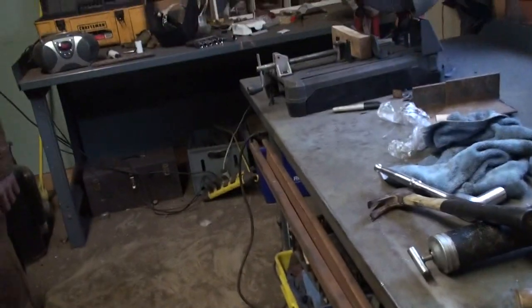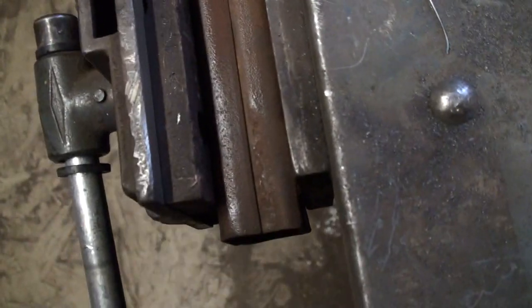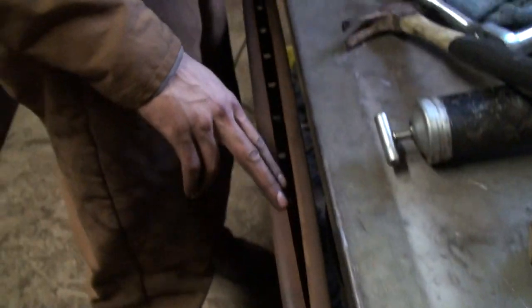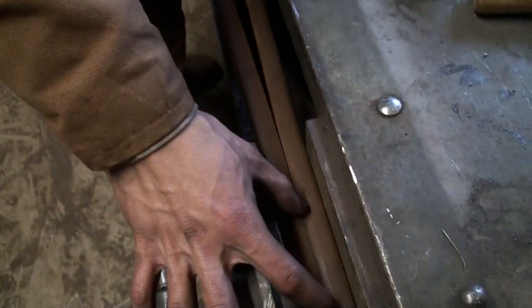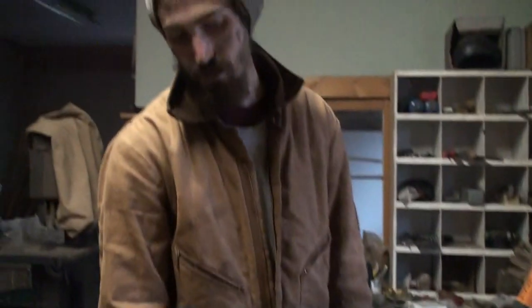And the next thing we're gonna do is I'm starting on the seat posts. So we're working with this funky fence posting. So I took a couple pieces of that, and what I've done is I've just clamped them together in a vise, and I'm gonna weld maybe an inch or two on the inside of this vise, and then do the next bit, inch or two, inch or two. And then we'll have that as an arm that can raise and lower for the seat.